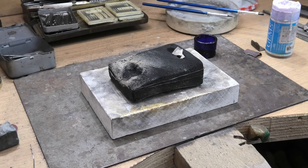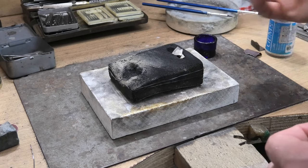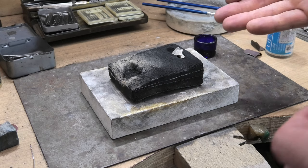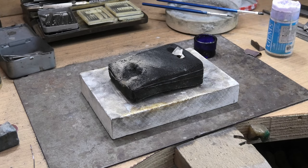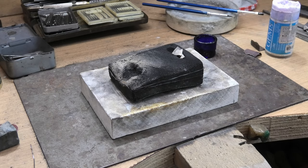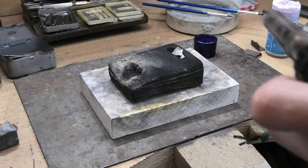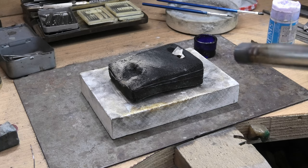Chuck your little bits of metal in the groove. I recommend standing up when you're doing melt-ups, just in case it pops or spits. It's something that's never happened to me, but it's possible — a little air bubble can pop and spit metal at you. You want to be able to jump back out of the way. Obviously if a block or something comes apart and molten metal falls, you just want to get out of the way and deal with it. You don't want molten metal landing on your body. I've only got this basic torch for soldering so it's slow for melt-ups — not ideal, but I'm making it work.